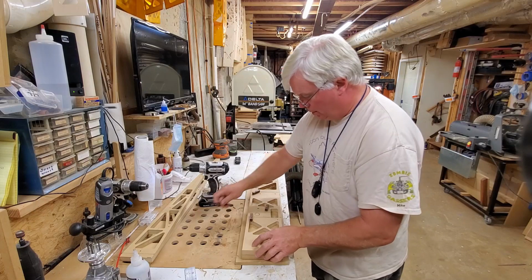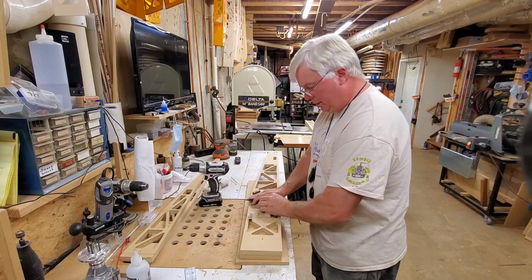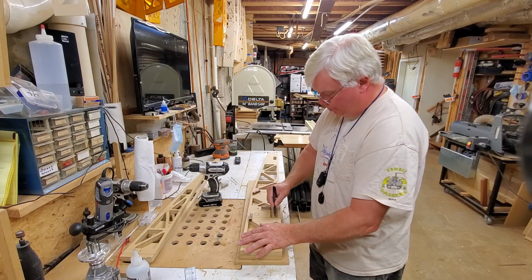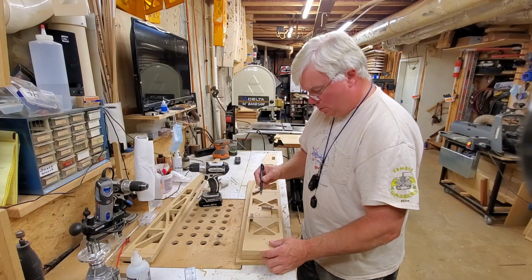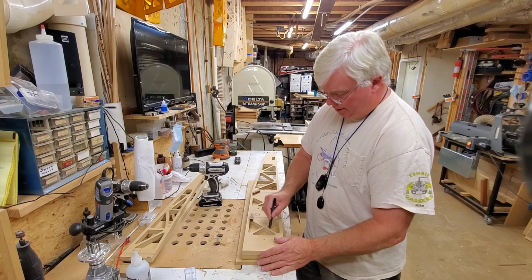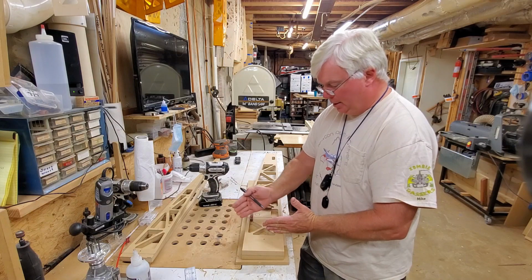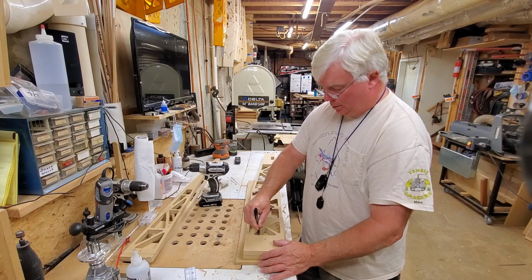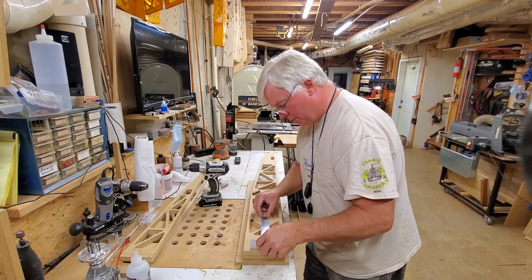All right, now what we will do is consider where we want these lightning holes to be. There's no reason that all of these back here can't match the side perfectly. So we'll go ahead and cut all those out. Just put a little mark on those that we are going to cut out. Let's see, this is the bottom and this is where the landing gear is. We do not want to cut that one out. So let's leave it blanked out. Remember, our landing gear needs some extra support there, so on the inside of the firewall, we're going to leave that intact, and leave this one intact as well, not take that lightning hole out. The reason is this aluminum bracket will ride across there, and that'll just give us some more epoxy room.